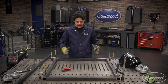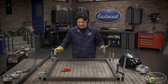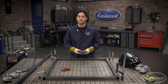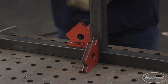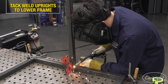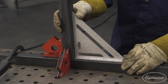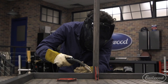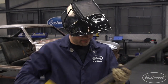What you just saw me do there is scribe the center line on the 30-inch pieces of tube steel. What you're gonna do is grab a square, grab a scribe — it's gonna be 16 and a half inches in from the ends, measuring with both of the tubes connected to each other. Mark that line, and then we're gonna get our uprights perpendicular to that tube and tack those in place as well. Quick tip: I do love the welding magnets — you can never have enough of those things, especially if you're welding by yourself. Always make sure you're nice and square before you move on with too many tack welds. This one is looking nice and straight, so we're all set to tack weld the rest.